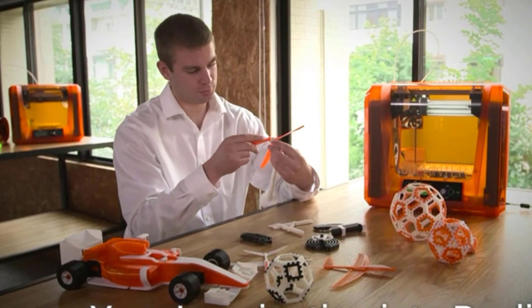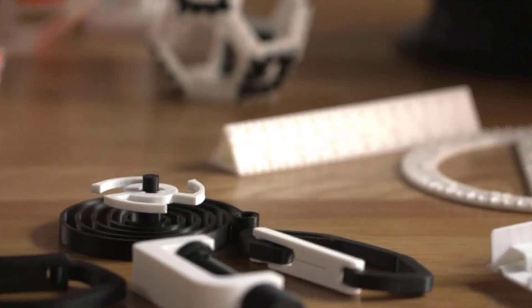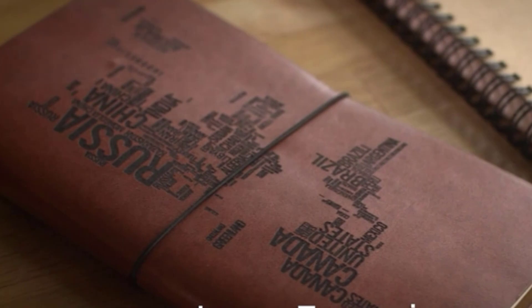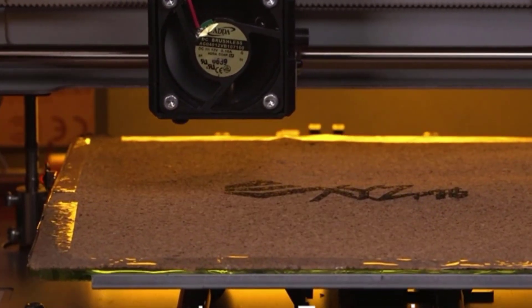However, we recommend adjusting the bed manually. We also noticed an improvement in filament loading speeds, but just adequate enough for beginners and occasional printers. We recommend upgrading to the hardened steel nozzle to get exotic prints and maximize the 6.9-inch by 6.9-inch by 6.9-inch print volume.